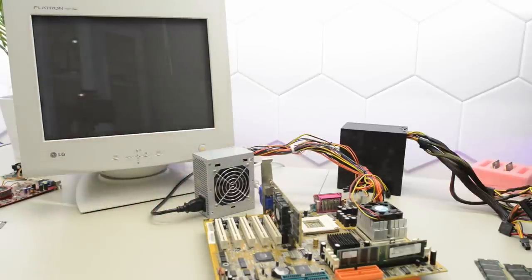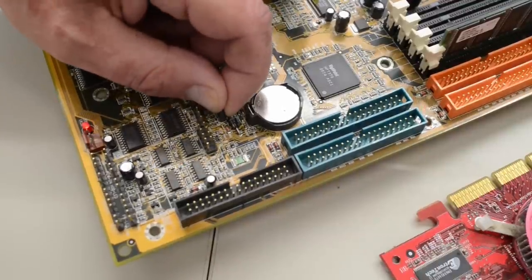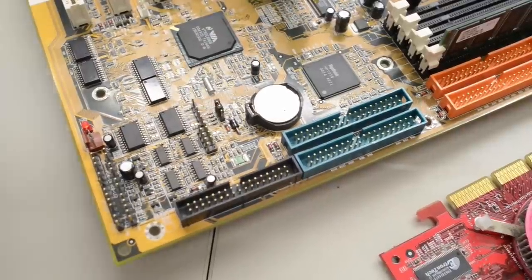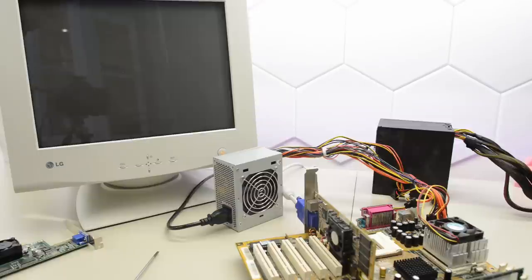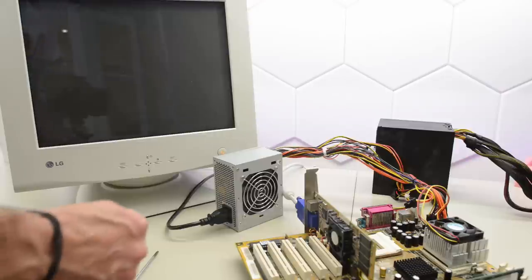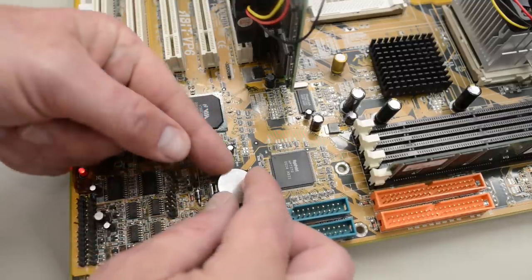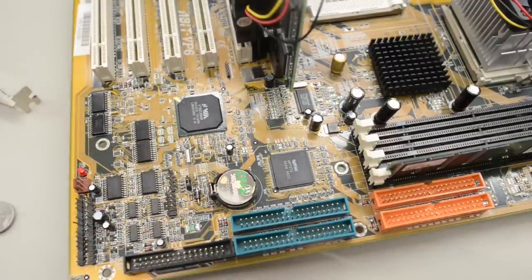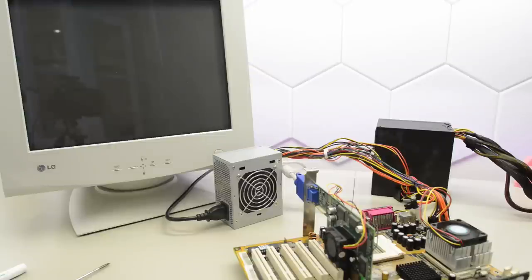Back at the VP6. Now we've tested the parts and have an absolutely tiny power supply. Let's try again. The fan spins up with only the power supply and the CPU. I assumed the CMOS battery was dead, so let's clear CMOS and do a final test. That's odd — now it's completely dead, the CPU fan doesn't even spin up. That was rather unexpected behavior, so let's replace that coin cell and do one more test. The fan spins up again, but we still have nothing on the display. That board is not quite alright.